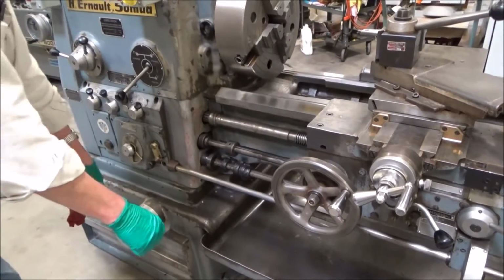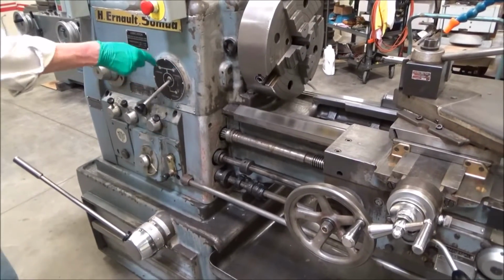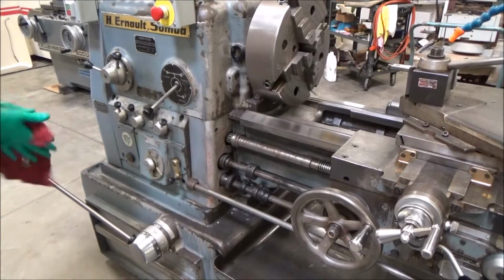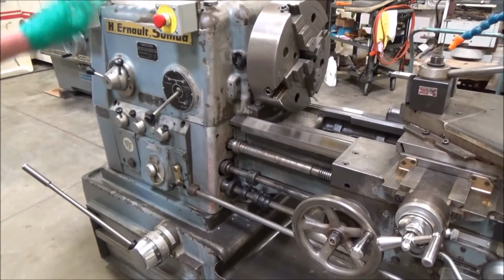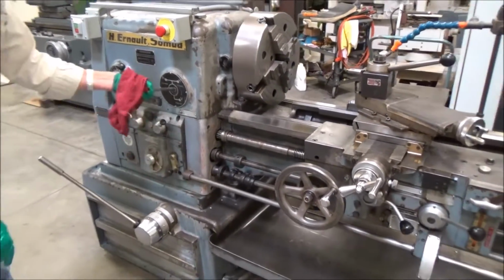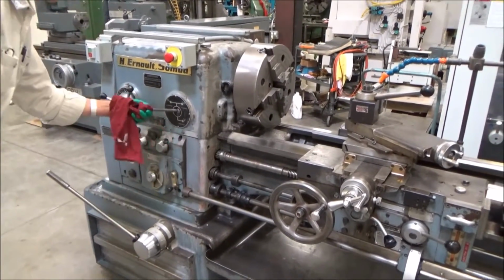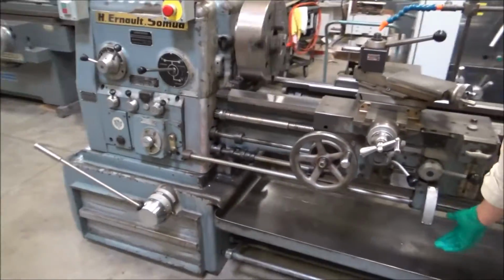We'll fire it up. This is the main spindle shifting lever for all the different speed ranges. And these are the 3 range gears inside the spindle box. There is a clutch down there, a little transmission working off the motor. So we're on now. There is no constant motor running. I'll just fire it up right there. We're at 1440 with high speed. We can start down and low, second gearing, 360 and 90. That's 90 we're in now. So just to show a little bit right there.